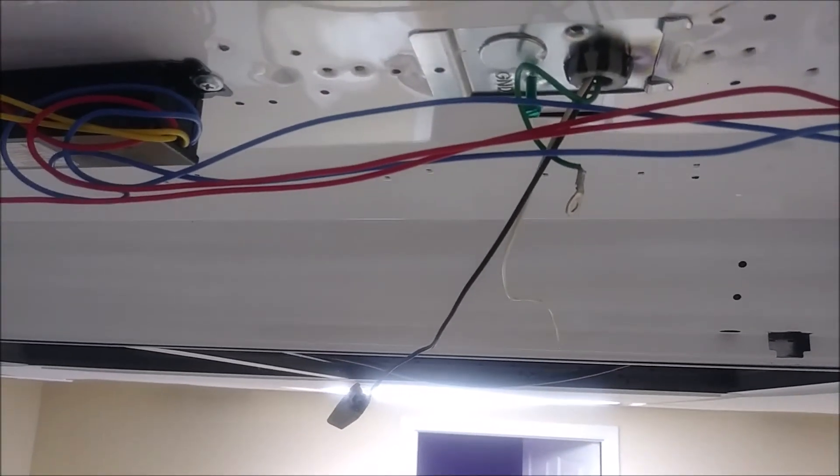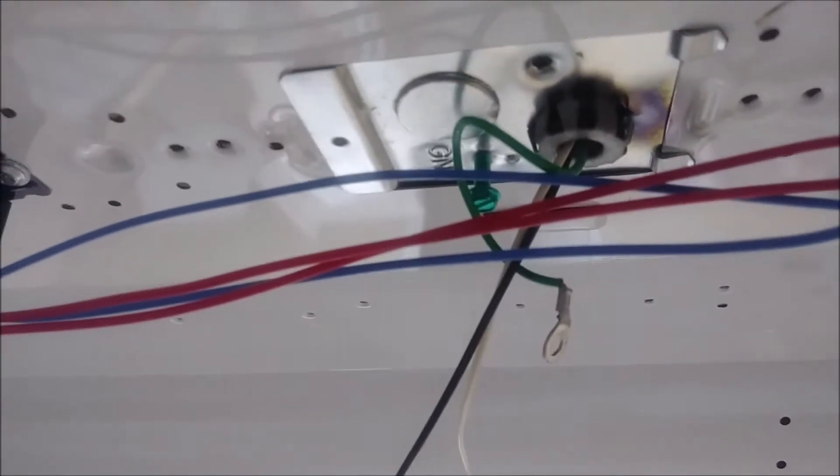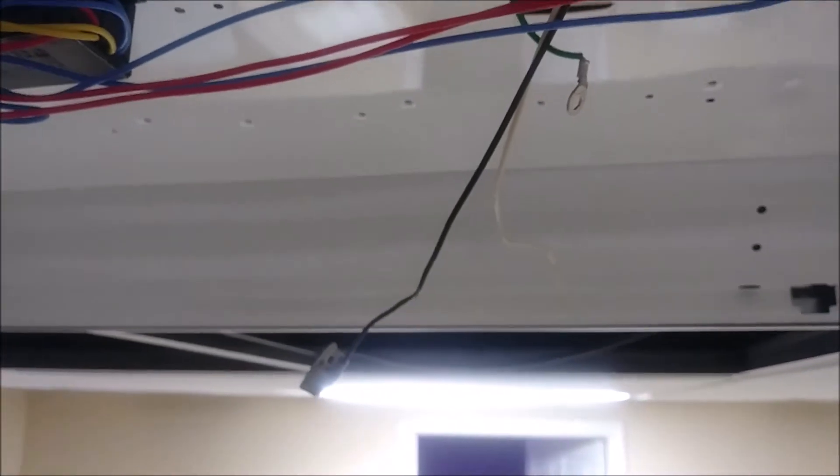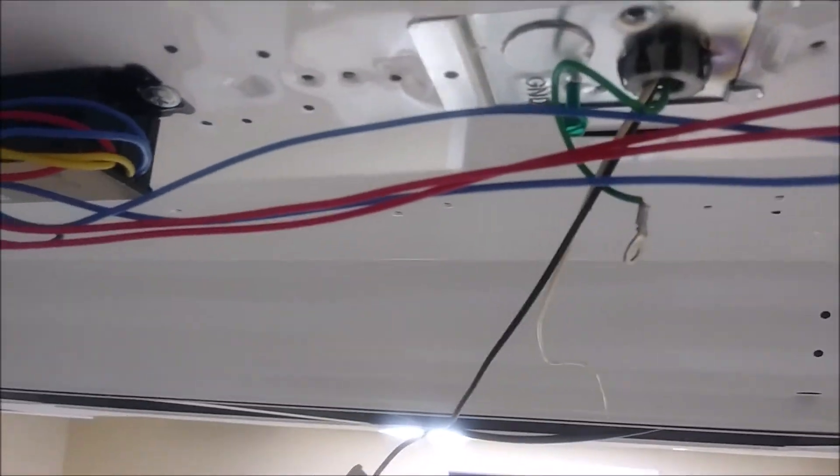That's the way it looks from here. You have to push the conduit in — as I did here, it's already pushed in. Looking at it from the inside after I push it in, you just push the conduit and it sticks to the metal; it cannot get out from this position. Now what's left to do is to connect these two wires and the ground to the fixture.